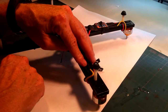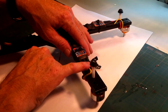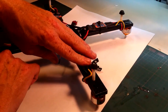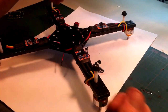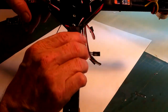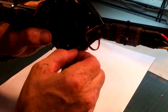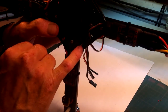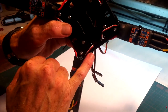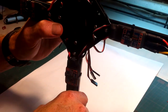You may be wondering which wire goes where — at this point we don't worry about that. We're just going to connect each of these wires to the three connections on an ESC and not worry which way is which. On the other end of the ESC you're going to have a red wire, a black wire, and a little three-wire connector with black, red, and white. The red is positive, the black is negative, and the white is your signal wire that goes to your KK2 board.